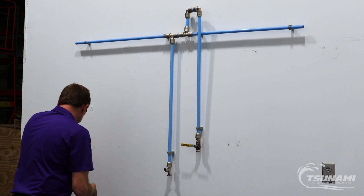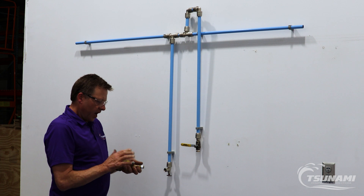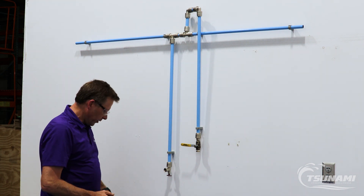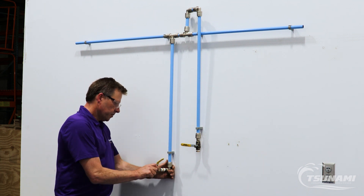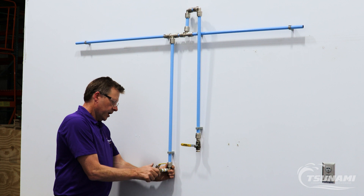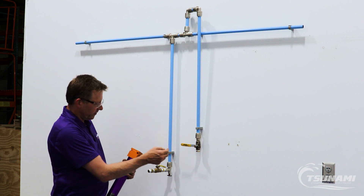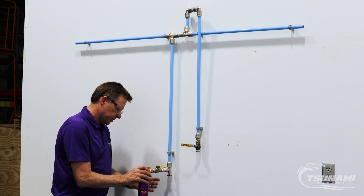Now, with that drain removed, whether I'm installing a water separator or the filter package, I always recommend putting a ball valve in-line in case I ever have to service the element inside the water separator or the coalescing filter on part of a two or three stage system. So I'm going to install the ball valve. All you need to do is pick up a couple of half-inch NPT fittings at the hardware store, get your half-inch ball valve, make sure you're going in the direction of flow — air is coming this way, and I want it to go into the inlet of the water separator.